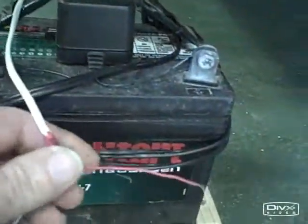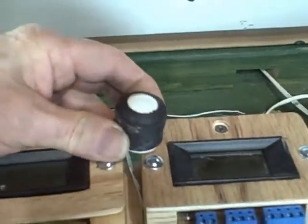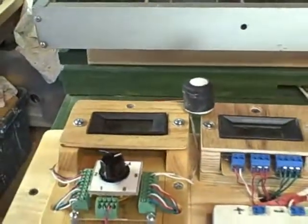This is our battery down here, just underneath our electronics board. You'll notice there's two wires, a white wire and a red wire. Remember, the red wire always goes to the positive terminal, so we're going to connect this red wire to the positive terminal — you can see a little plus sign on the battery itself. We've connected our PV panel and all our other connections. This sensor here will be used to monitor the amount of solar energy available, or solar flux. When you change the six-position monitor to position four, that will give you an indication of how much sunlight is available.